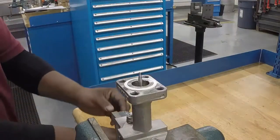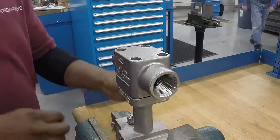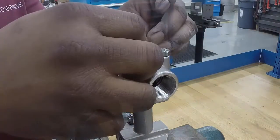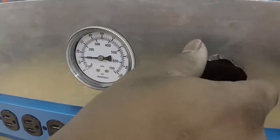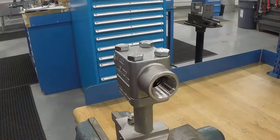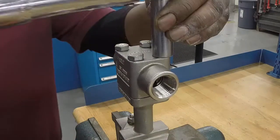Now you are ready to join the body back onto the valve. Be very careful when placing the body onto the valve, as microflow trim components are very thin and can damage easily. After hand tightening the bolts onto the body, slowly remove the pneumatic air pressure to the actuator. Refer to the Mark 708 instruction and maintenance guide for the appropriate body bolt torque rating.